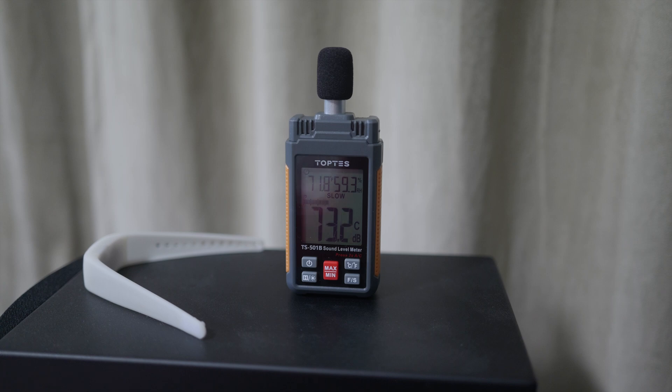We're going to play the test tones, let the white noise play, and adjust it on the SPL meter so it reads 75 dB. It looks like we got it around 75.2, 75.7 — it was hovering around there, so that's probably our best bet. That's all you do — it's really, really easy, especially with the SACD. Put your SPL meter on C-weighting, set it to slow, go into the AVR, turn your volume all the way up to reference, play the white noise, and once you get to 75 decibels, move on to your next speaker.